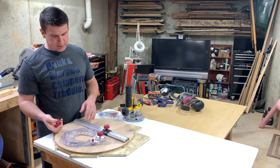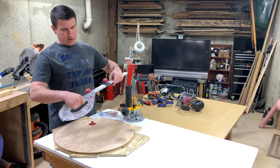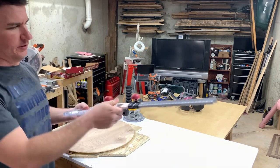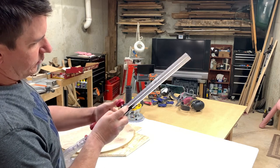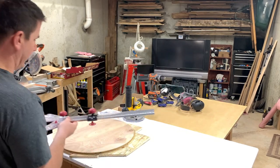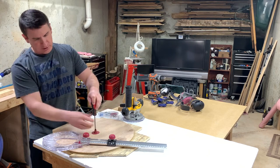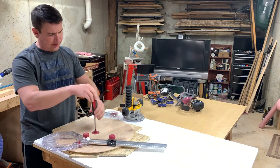This is called the Miles Craft Turn Lock Quick Circle Guide Kit. The way it works is this piece goes into here and tightens down. You have measurements on the side to determine how big you want it. You have inside and outside of the cut — I want the inside diameter to be 18 inches, and this accounts for the size of the bit. So I put that inside line right on the 18 and now I'll get an 18-inch circle. It runs off this little piece that goes into the center hole. If you didn't already have the center hole, you'd just measure 9.5 inches from each side of the plywood since the diameter is 18 inches, always leaving a half inch on the sides for clearance.